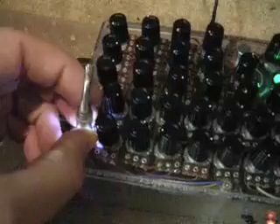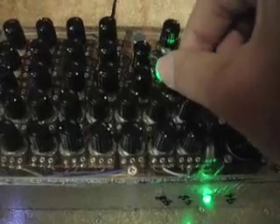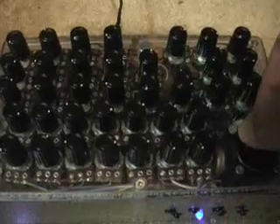If we're in the dark, the LED on the neck here can be used to shine a flashlight on the photo cell, which always stays on. Right now we're just listening to oscillator number two, and if we listen to both oscillators one and two together — remember I have the sequencer running into oscillator number one, so that's why we hear that really strange sequence sound. Even if we turn down oscillator number one all the way, you can still hear the sequencer, because the second oscillator is being frequency modulated, creating this interesting sound.